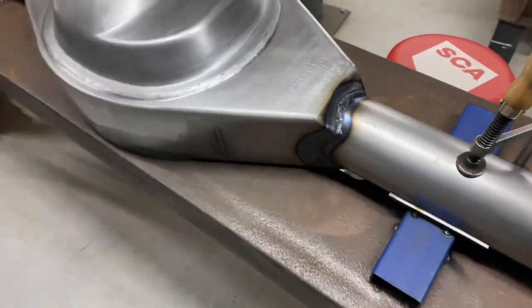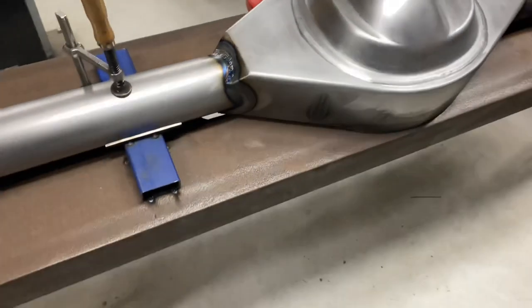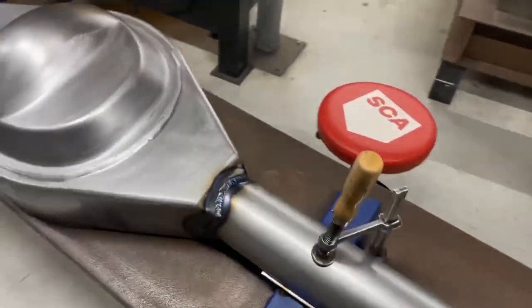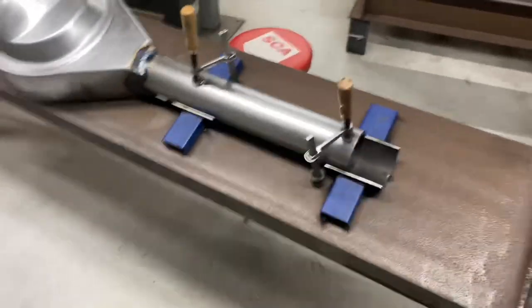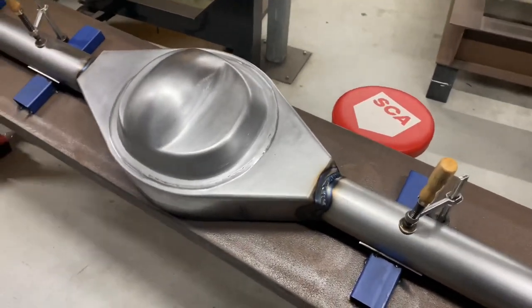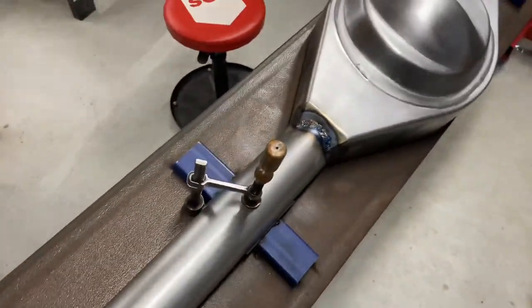So this is all welded up - the second pass. Pretty big welds now, which is good. They kind of turned into a bit of a weave at a couple of points. You're never really going to know the difference - I'm going to knock the top off a little bit of it when I hit it with the orbital sander, and obviously it's going to get powder coated as well. So you're not going to really notice it. But all the insides are super, super heavy and gnarly. So there it is - my first diff build, I guess. I'm going to go ahead and let that fully cool down to the touch. I'm not going to bother messing with it until it's fully, fully cool - like ice cool. Probably won't even touch it until tomorrow morning. Pretty excited about that - nothing really went out of play.